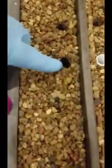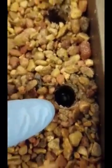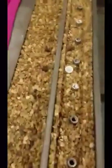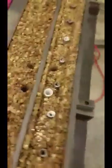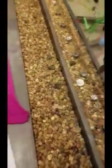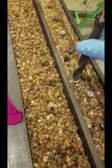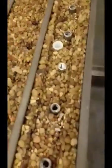If you need to make wells or access points for screws — there's a screw down in there I need access to later — PEX pipe, water piping, works really well. The epoxy will just barely stick to it, and if it does hang up in there and you can't get it out, you can take a drill and a 5/8 bit. It will cut almost all the way through but not quite, leaving a thin liner inside the hole, and then that liner will pull out really easily.